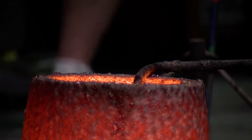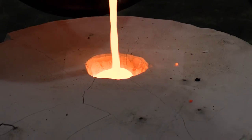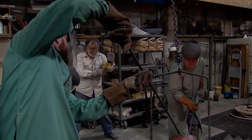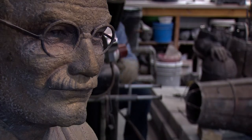2,150 degrees — let's go with it. We eliminate the wax that's in the molds, and the hollow cavity left where the wax used to be is where we can now pour the bronze in. When you're handling that much molten metal at excess of 2,000 degrees, it's a very interesting, difficult, fun, and marginally dangerous activity. And then after we've poured the bronze in, we can break the mold apart and see what we have.